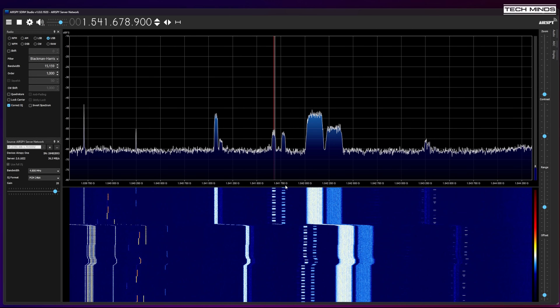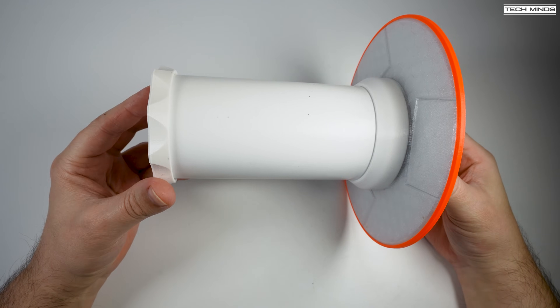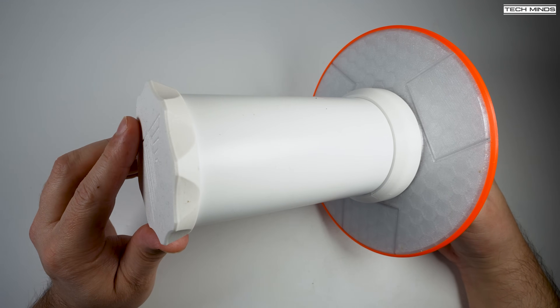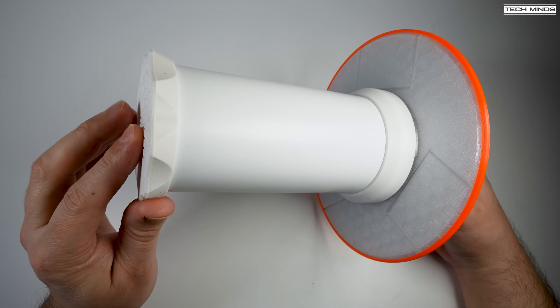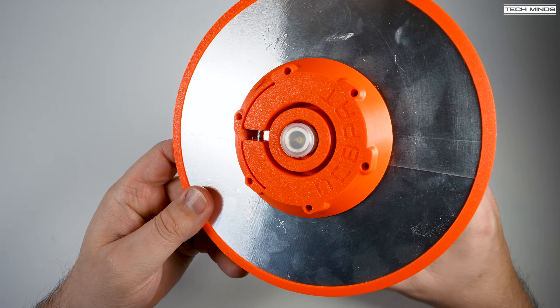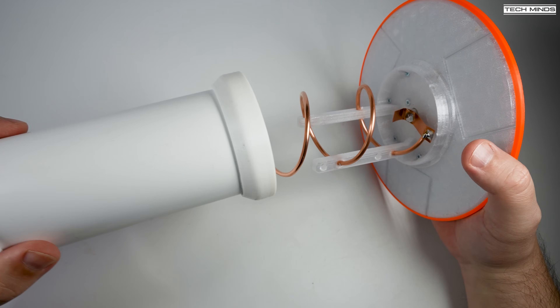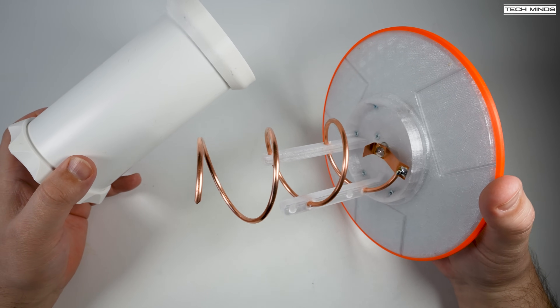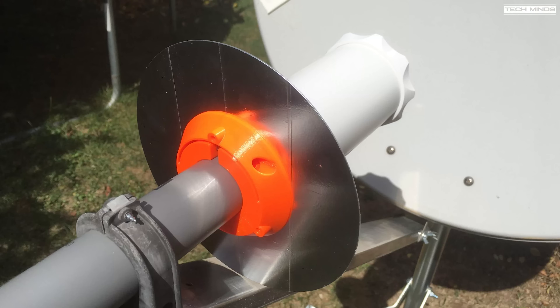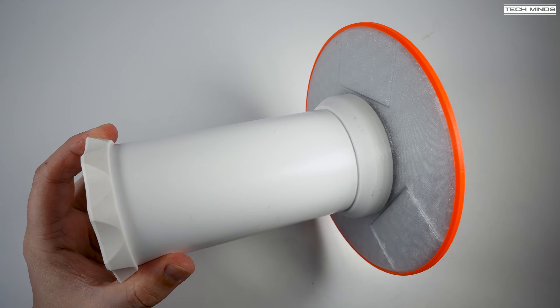At the time of organizing to receive this antenna I also got another antenna, but this time it's left-hand circular polarized as opposed to the right-hand circular polarized antenna we use for direct pointing at Inmarsat. It's designed to be used with a satellite dish, and when facing an antenna towards a satellite dish the circular polarization gets reversed. I'll be making a dedicated video on that antenna very soon, testing how well it works compared to the antenna shown in this video.